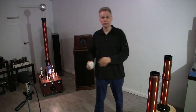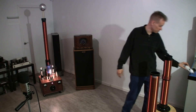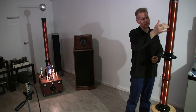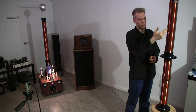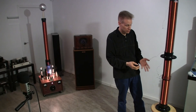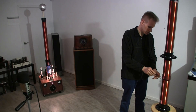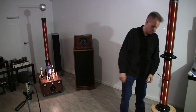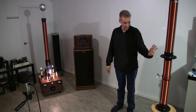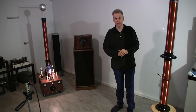Now what I'm going to do is make this electrically equivalent to the source coil. I'll act as the tuning capacitor — I'll be the big human tuning capacitor. I'll take this coil and put it on top of this one. I've got little neon bulbs on these coils as tuning aids. I'll clip these two coils together so they become very electrically similar to the oscillator coil. When I clip it and move away, you can see the little neon bulbs are lighting up. The impedance of that circuit being a little different is why that neon bulb gets bright — but we'll stick to the resonation part.